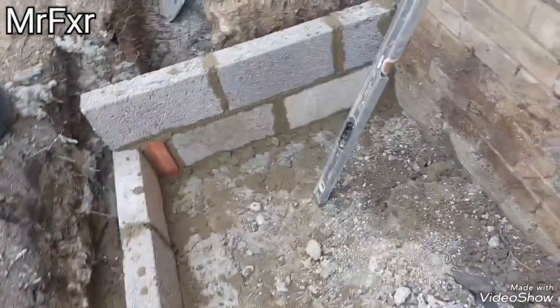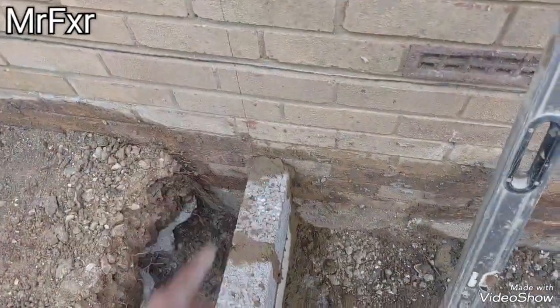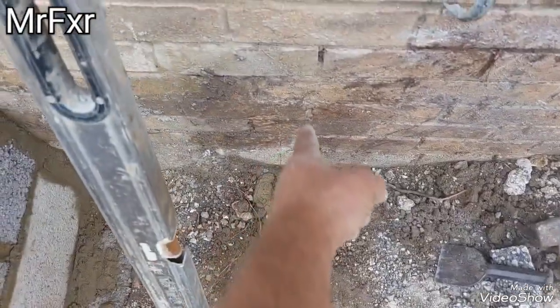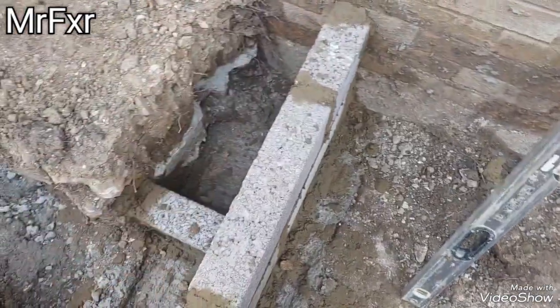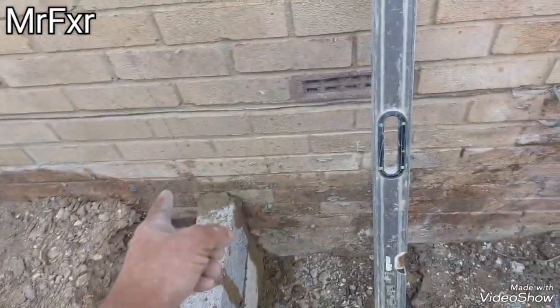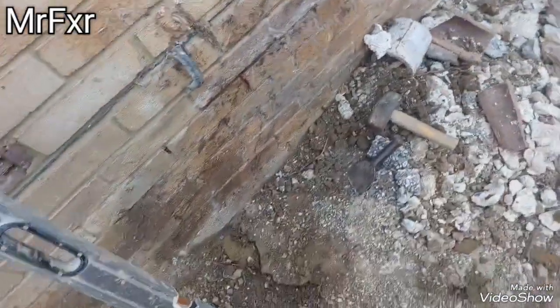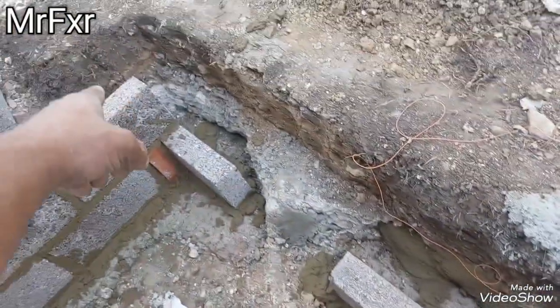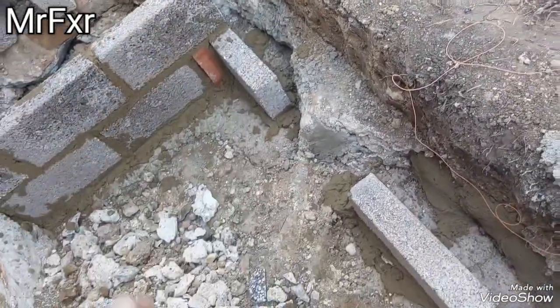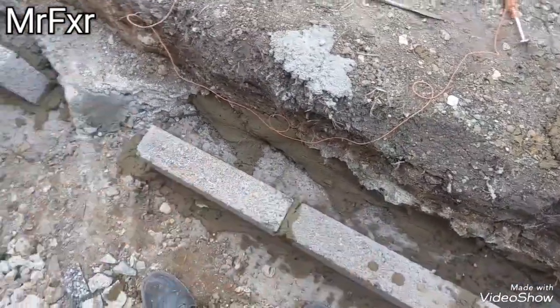So as you could see, I done 3, 4, 5 of that corner there from that mark. It's my 600 there, 800 was somewhere here, meter across, and that was my square line off the building. And then whatever I had here, which was 2285, I believe, measurement, I transferred that measurement from this corner out to that corner, 1150 over, and placed them two blocks in the line, did the outer one, and then went back into the building on both ends.